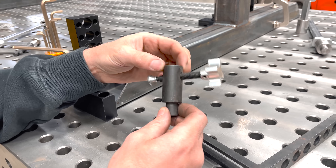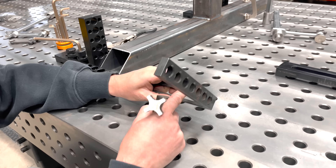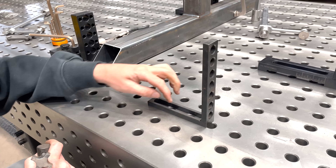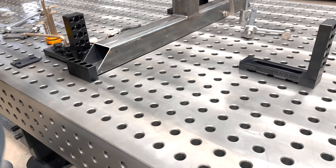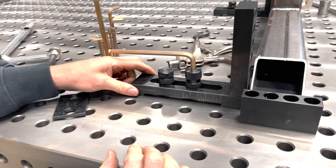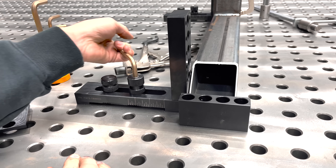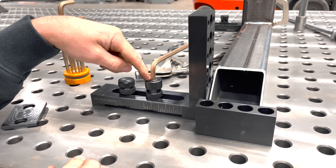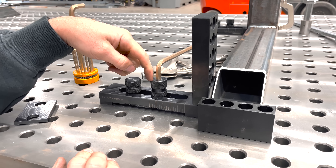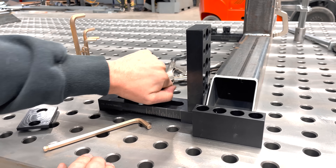These side pushers have a lot of pushing force, and when coupled with a slotted fixture mounted to your table using a bolt — like I have here — this can slide back and forth. When you tighten the bolt to hold it into position, these are only supposed to be torqued to about 10 foot pounds or so — very light force.